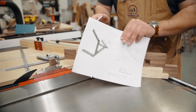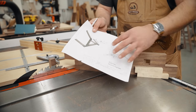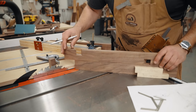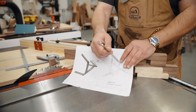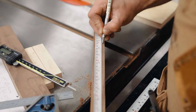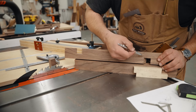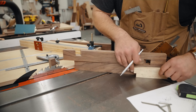Here's the way you can do this with one measurement — so easy. You measure to the center of your board. The plans will include an equilateral triangle you can print full size and set your bevel gauge off of. We know from the plans that the inside of our triangle is 11.31 — I did 11.25 to make the math easy. I measured to the center of my board, marked it with a square, and then half of 11.25 is 5 and 5 eighths. I measured that from the line, marked one line, and I'll show you with the spacer how we do it.